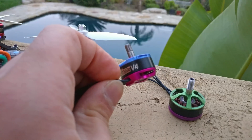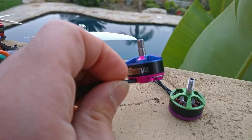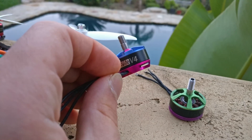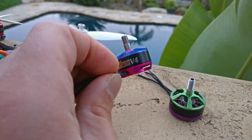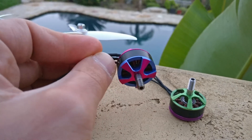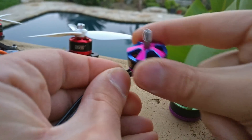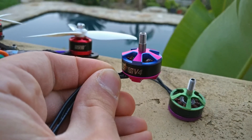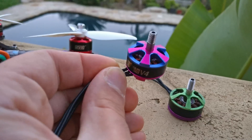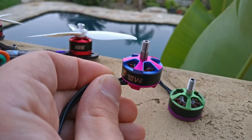So what's the main difference between a taller and a wider stator? A taller stator gives you better power — performance higher up in the RPM range. A wider stator gives you better torque and a better gyroscopic effect. Companies test this by spinning the motor fast on a jig and measuring how much gyroscopic resistance the motor has. A wider stator will give it a better ability to resist gyroscopic movement.